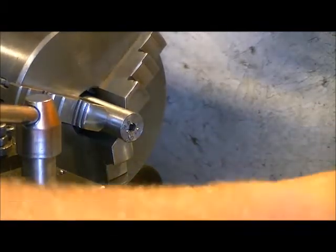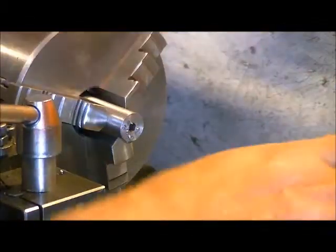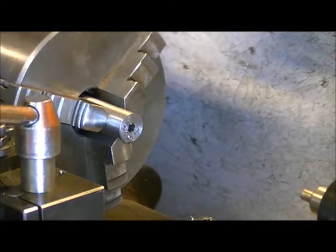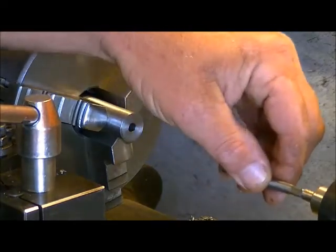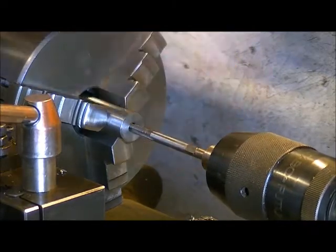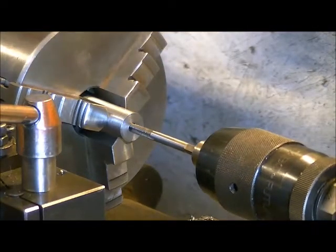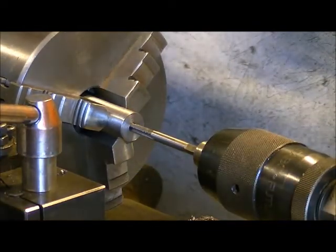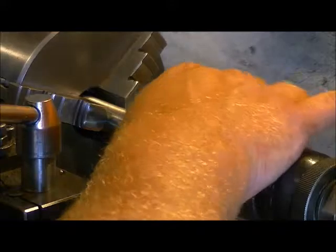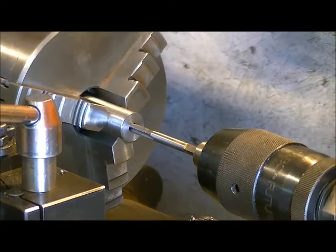Next thing we got to do is put on the little tap assist tool that I had made a while back, and I have different end pieces that go on this, and it's spring loaded. You'll see how that works, but this is going to ensure a proper 90 degree surface for the tap so that it sits even and you get a proper set of threads, so you're not going to cross thread anything or have any of that sort of problem happen. So what I like to do with this is I'll push it in first initially, make sure everything's sitting good and even, and then I'll lock it down. Now, what I got to do is get a little wrench in there. Find one that fits.